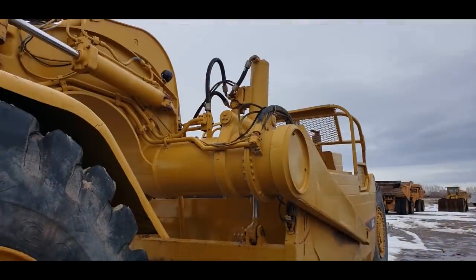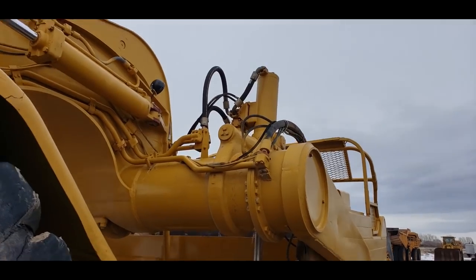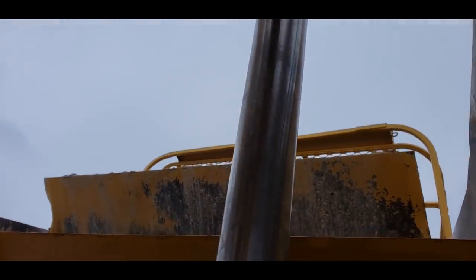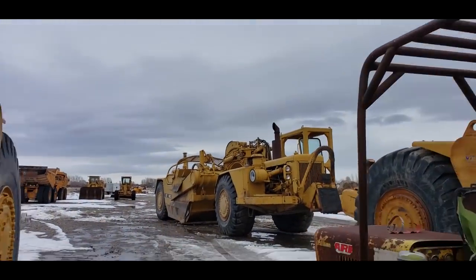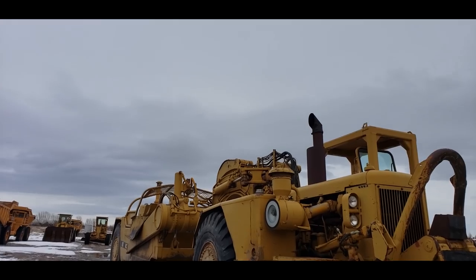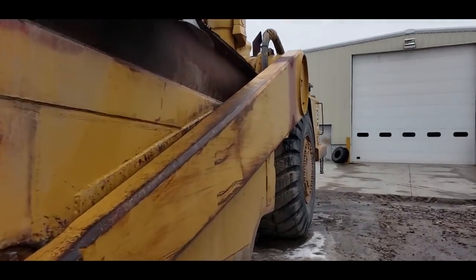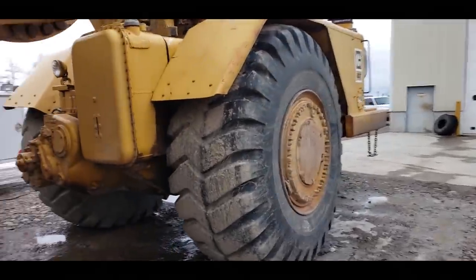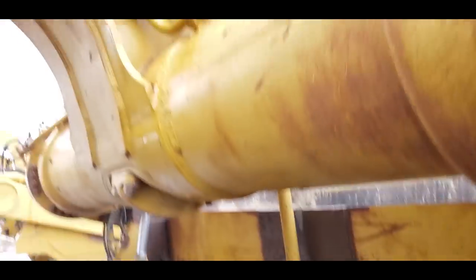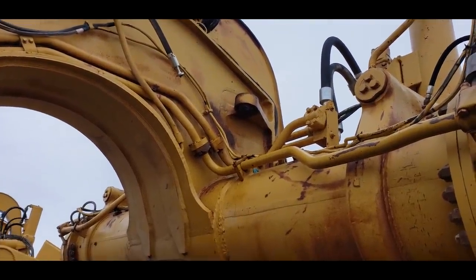So the boys, they've got the one cylinder on number one here and all those new hoses up there that replaced all that. We're just waiting for the other one to be re-chromed. I got the pin in. They moved the Filthy Whore over here so we can get access to it with the service truck. We've got to pull the right steering ram off and reseal it. And I've taken the hydraulic steering cylinder off this one into S&G Electric, and they are using their vertical mill to bore the end of the ram where it goes right there and put bearings in it. And Jake has just welded the bearing out of that one there so we can replace it.